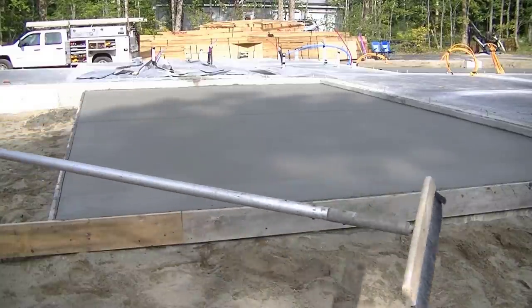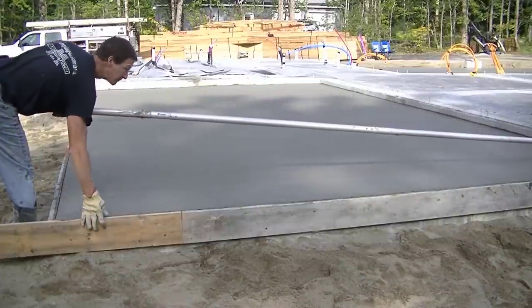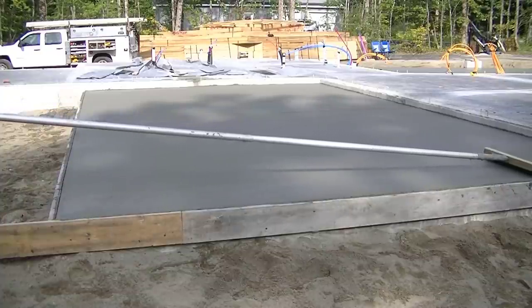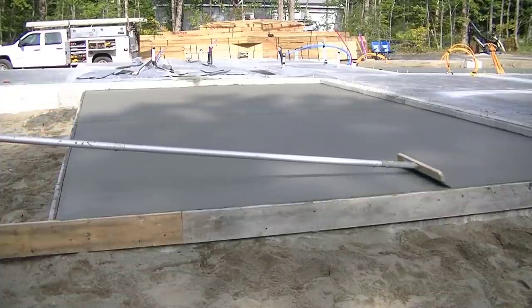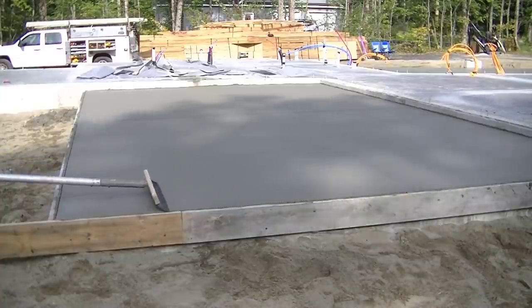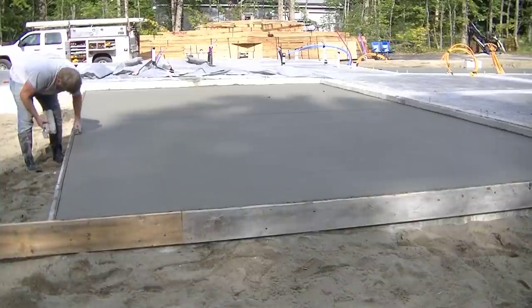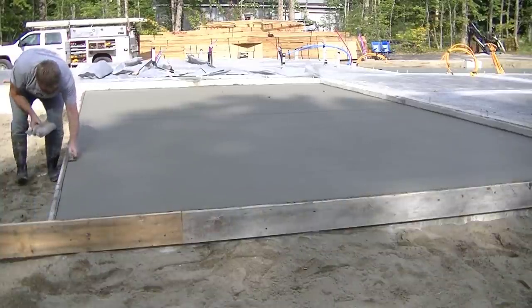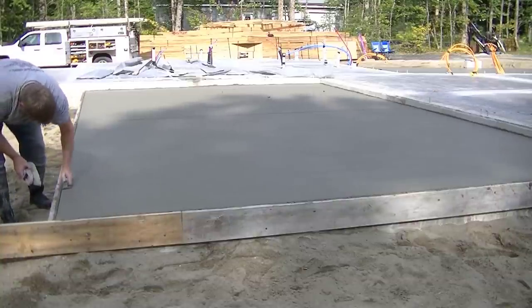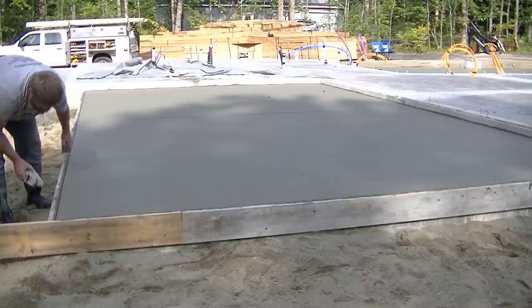You can see how consistent that broom finish looks — that's key. You want the broom finish to look all the same when you're done, because if it doesn't, it'll look funny when it cures out too. The shade here was helping us a little bit. This is probably around nine o'clock in the morning and the concrete was setting up pretty good. There's Darren putting on the finishing touches. Again guys, thanks for watching — come on back and we'll see you on the next one.